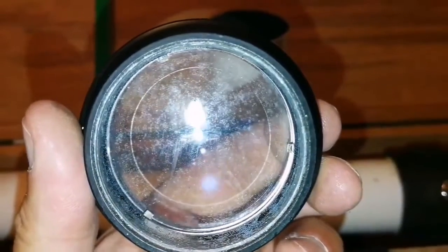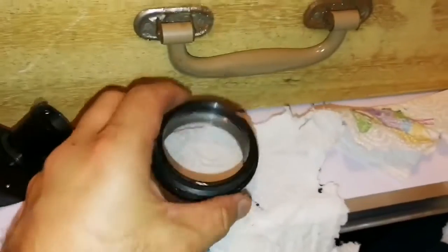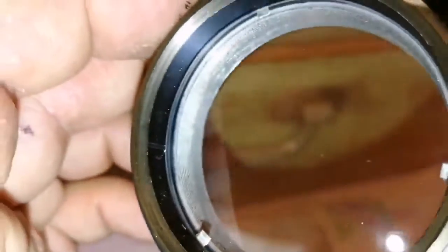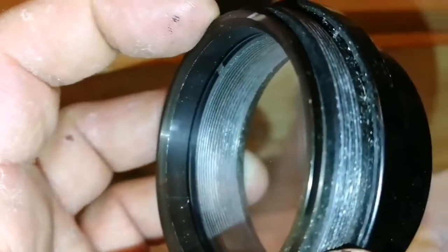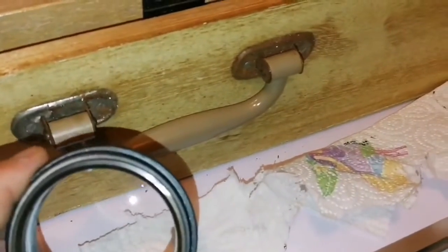I have to clean it. It looks full of dirt and probably a little bit of fungus — even a lot of fungus actually. So let's see what we can do with this lens. I have cleaned the lens and blackened the edges to reduce internal reflection. Two lenses — it's a doublet, in contact together. I prefer they had some distance between each other, but anyway. To remove it, I had to remove the O-ring and then the lens comes out. Be careful about orientation when putting the lenses back. This lens is now ready, I'll put it back.